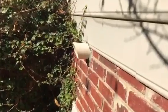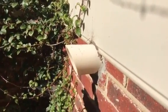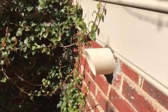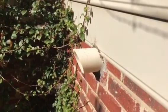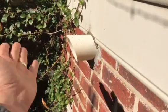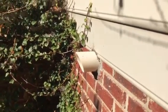Okay, I wish it was a little bit longer, for two reasons. I think it'll be okay, but I'd be comfortable if it was about a foot long. And then I like to get a more drastic cut, I call these baloney cuts. Got that name from the old Harley drag pipe style. But the angled cut, while the pipe is definitely designed to carry condensation water back through the furnace into the drains, I just don't want to invite rain to add to that volume, so I cut that angle cut to give it kind of a hat across the top. But nonetheless, I'll probably leave this like this,